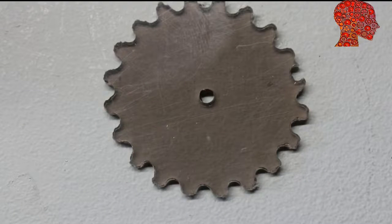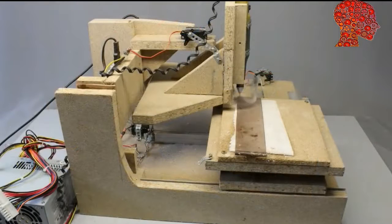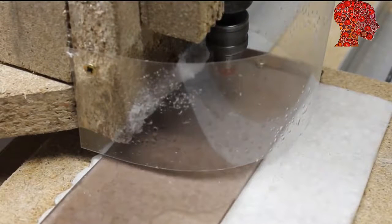Next I was cutting gear wheels from 2mm acrylic plastic. The result was disappointing. The poor quality was mainly caused by deflections along the vertical axis of the mechanism. For CNC machines, solid isn't always solid enough. After reinforcing the machine and changing the mechanism used to lift and lower the router, I started a second run.